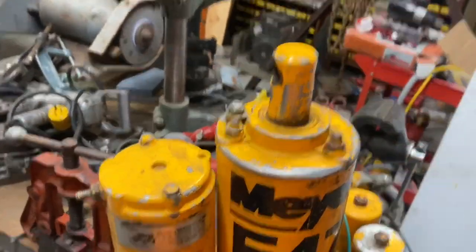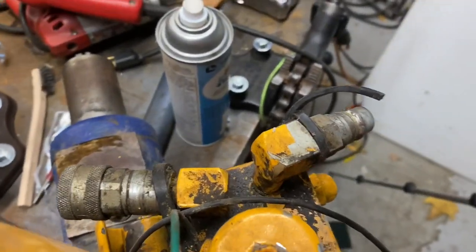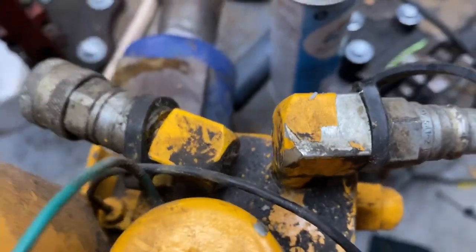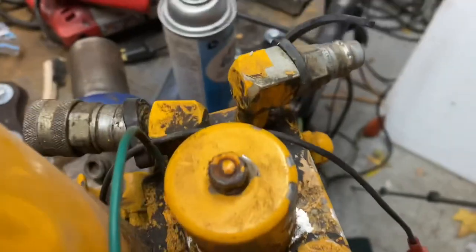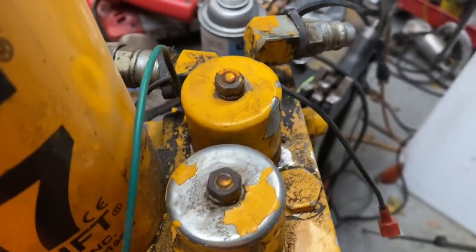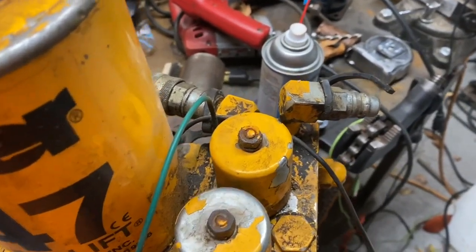This guy here is what raises the plow and these connections swing the blade side to side. The problem is it's a little bent. I don't know if it damaged the threads. Can't say how hard it hit it, but we'll focus there. Screw it down and see what it looks like. Because if it only damaged the very top part, you can peen it back and I've had a lot of luck with that. If it's too bad, of course, you just drill it out and re-tap it. It's pipe thread.